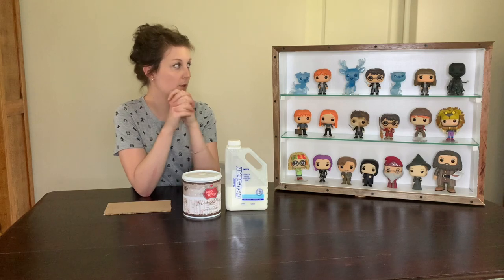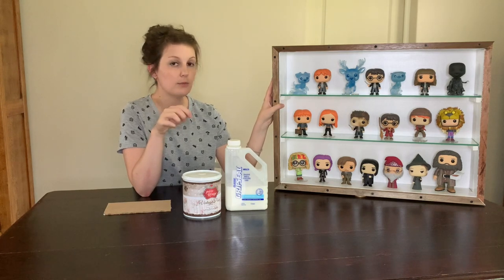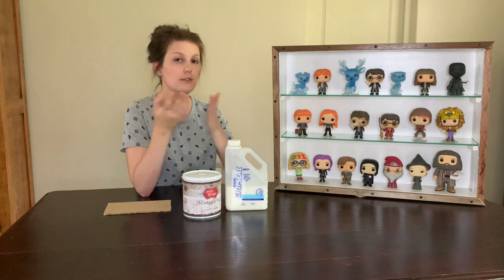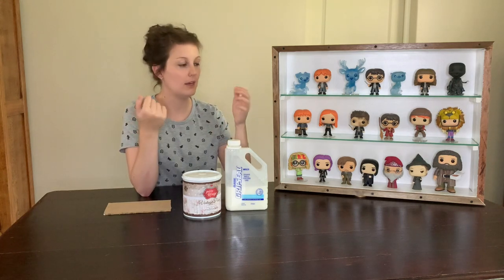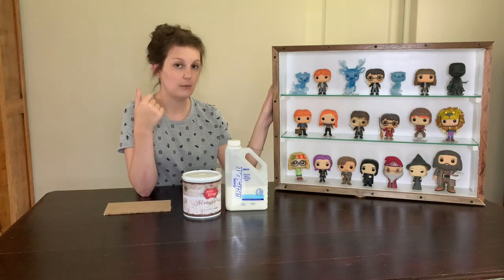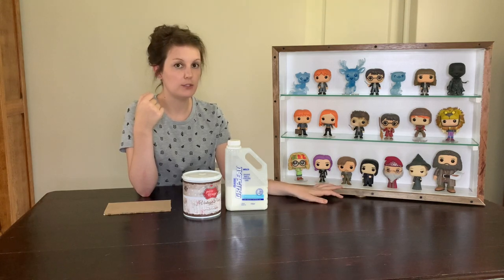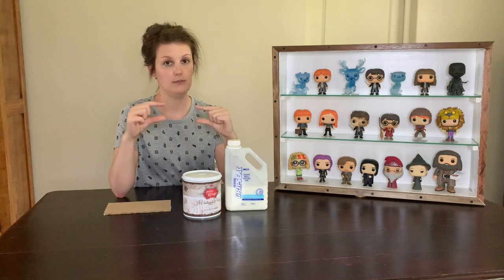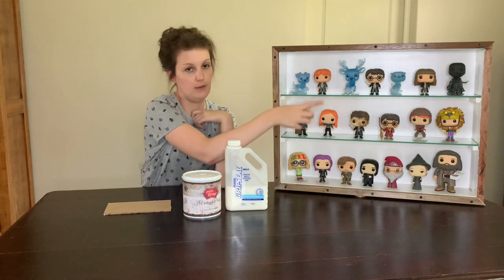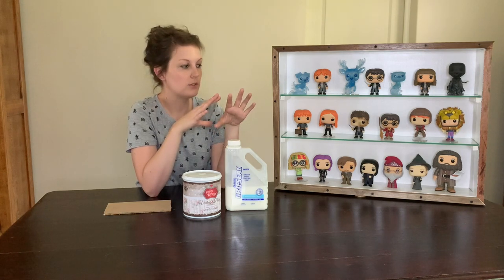What I've done is build the frame, but because a lot of the wood was taken out by force, a lot of the lips broke off. So many pieces have only the grooves left. The thickness of the wood is two centimeters, so I cut two centimeters off the groove side — basically taking it from that shape to this. The glass slides in and out of that groove all the way around, and I have a small piece that fits in on one side, which finishes the cabinet nicely and helps keep the dust out.